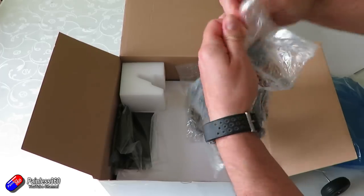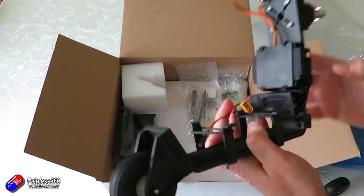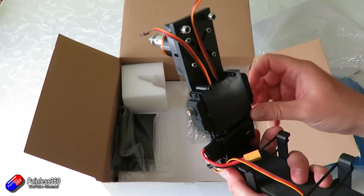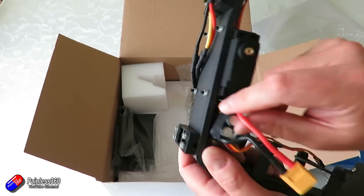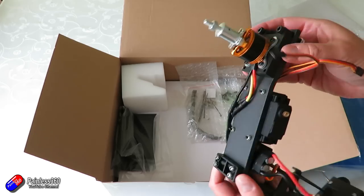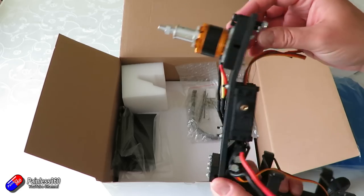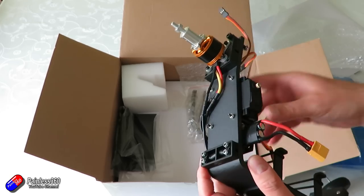We have the aluminium gondola itself, also called the cart. This is my first paramotor — I've never had one before, though I've flown helicopters, multirotors, planes, wings, and all kinds of stuff. This is a really heavy piece of kit. We have the front wheel, high torque servos on the sides for brake line controls, a 50 amp ESC with a 5 amp BEC, the motor — a 3530 1400 kV brushless — and that's going to be swinging a 10 by 4.7 inch prop.